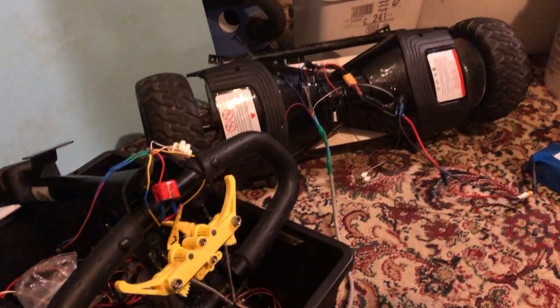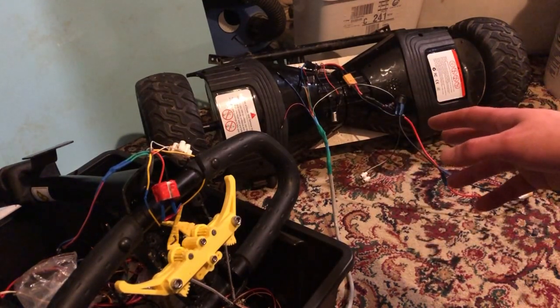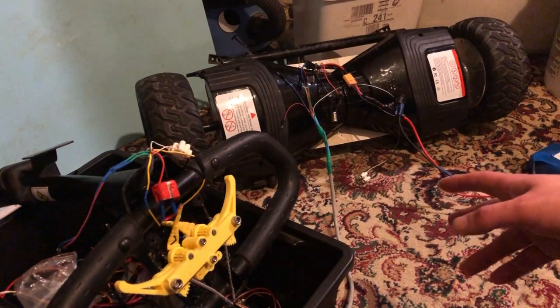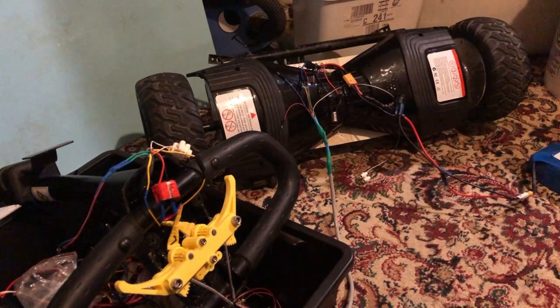Right, so after probably 2 days of pissing about, the first day we were just trying to fix the mobility scooter, try and make it work with what I had. Decided that wasn't going to happen, so connected up some potentiometers to this hoverboard. I got that working, that was all okay. I managed to reprogram the firmware, and I've even edited this firmware as well. So I'm gonna try and find somewhere I can stick it online, and then I'll put that in the description for anybody who wants it.